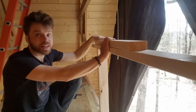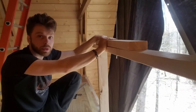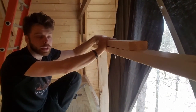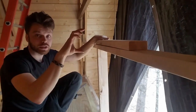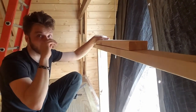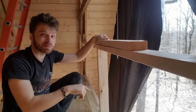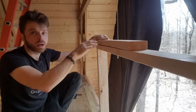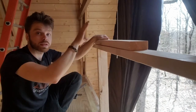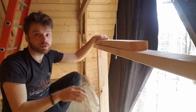There's another reason — there's a collar beam built into the structural framing and that collar beam is 3.5 inches wide, so 2x4. I want these other beams that are going to be visible along with that collar beam from the outside to be the same thickness so that it has a consistent profile.